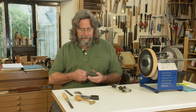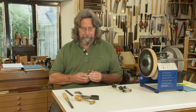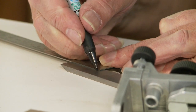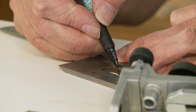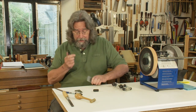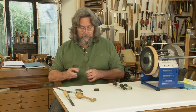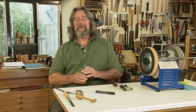I'd like to show you the grinding of my low angle jack blade as an example of exactly how you set about using the jig. I find it very useful these days to mark my projection on the plane blade — it's one less thing to think about when you're trying to clamp it into the jig and get it square. I'm also going to black the bevelled side so that I can show you what's happened when I've done it. I love this technique of putting black onto bevels for grinding and honing because it shows you exactly what's happening.